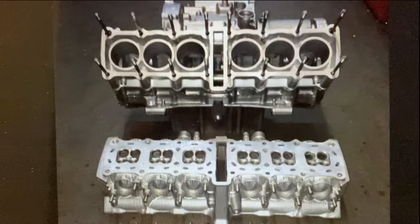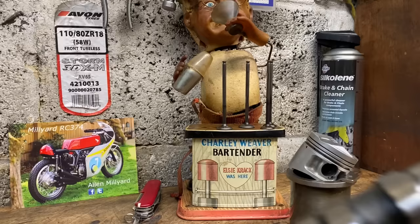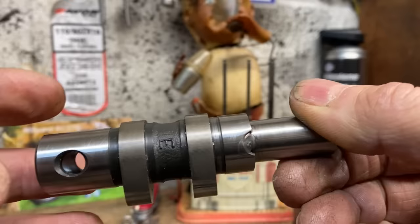With the cylinder head, barrels and crankcases basically finished, it was time to think about the camshafts. I cut the camshafts up with my angle grinder so I could rephase the lobes at 120 degrees. Each part of the camshaft was bored on my lathe to accept a gudgeon pin from an old piston. Then I could press the camshafts together really tight, twist them to the required angle, and then spot weld them with my TIG welder.